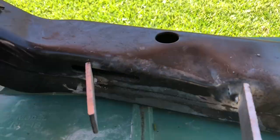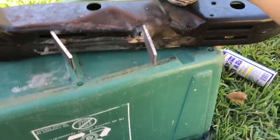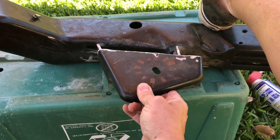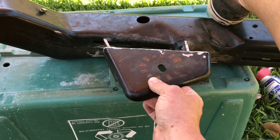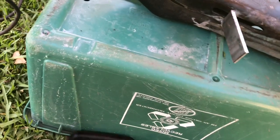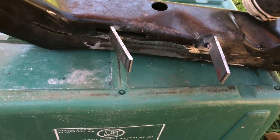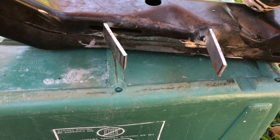The point of these two brackets is to hold this out here like this. I've welded it inward a little bit so I can float this around a little bit side to side, front to back. Because when this comes forward, you're bringing it an inch and a quarter forward towards the front of the truck. I've got a couple magnets here - I'm just going to plop these right on top here, right on top of the other piece, situate it where I need it to be. It's an inch and a half up now, just need to get an inch and a quarter forward. Then I'll go ahead and weld it to these brackets and make filler plates to go around and hold it in there.